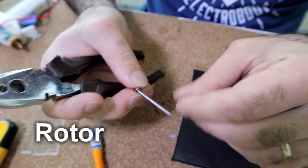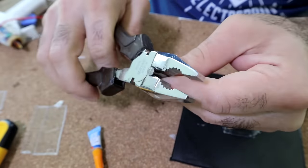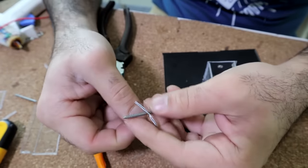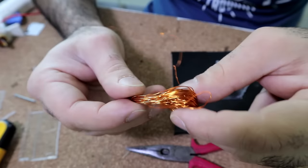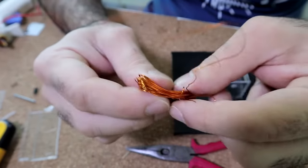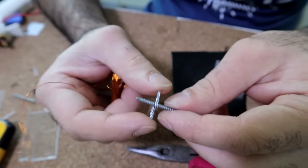Then we just poke two holes right between the magnets on the walls. Now to make the rotor — the part of the motor that rotates — we take a nail and cut the end off. Then we take some steel wire and twist it around the nail to shape a cross, something like this, a little bit off-center and the same length on both sides. Now we get some magnet wire, which is basically coated copper wire — we can get this from old wall adapters — and wrap it always in the same direction around the steel wire.